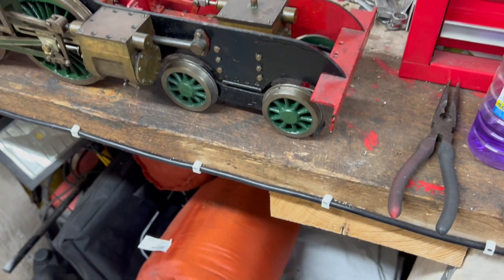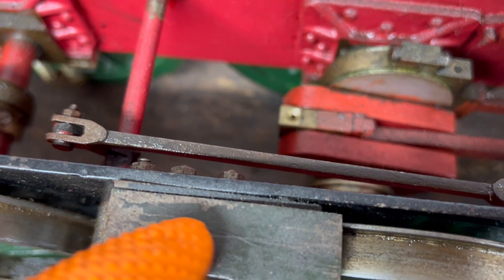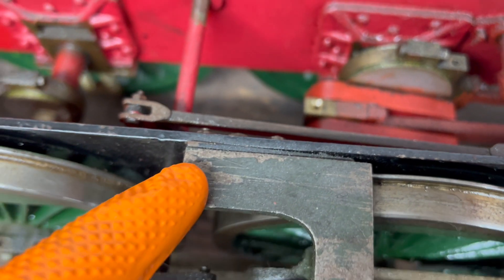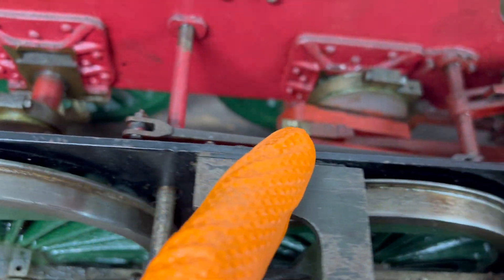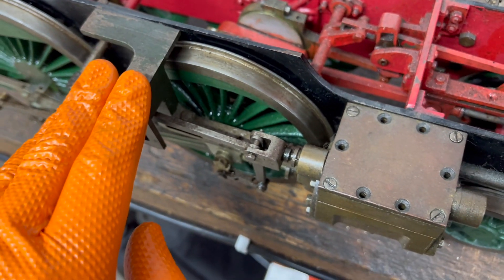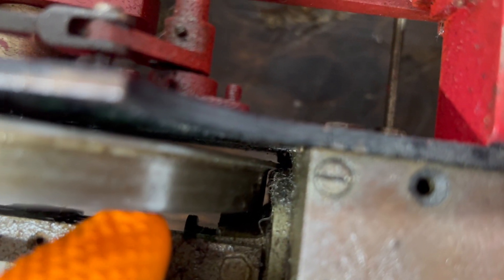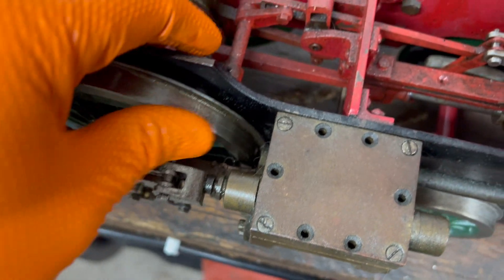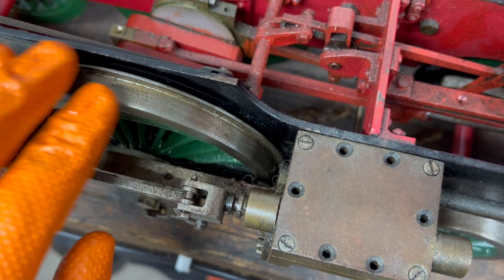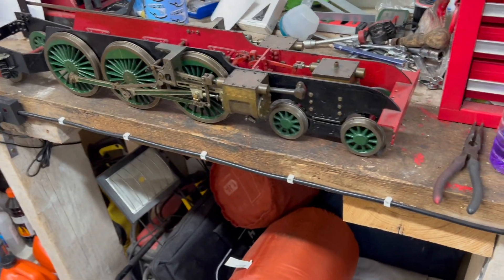Things that I feel could be improved or may need to be looked at: there appears to be a little packing piece in here beside this bracket — I'm wondering was this just cut too short and that's to remedy that, in which case I am totally on board with it, keep it simple. The other thing is there doesn't appear to be a huge amount of clearance between the front of this wheel and the inside of this cylinder. That might be an issue, but maybe not as things move with running in — perhaps it will resolve itself.